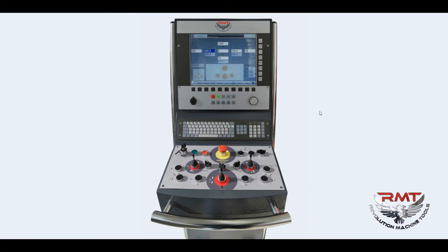In semi-automatic mode, the operator can teach the machine. The operator just works manually, and at the same time the control unit records all operator steps. After the teach process, the machine is able to repeat all of the operator's recorded steps.